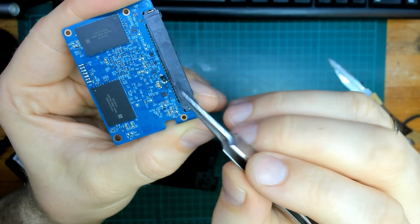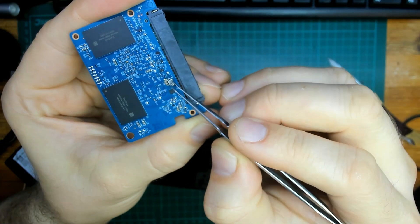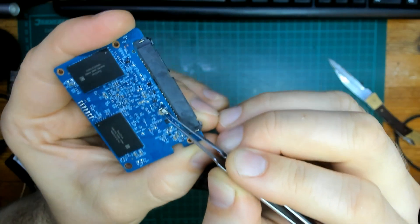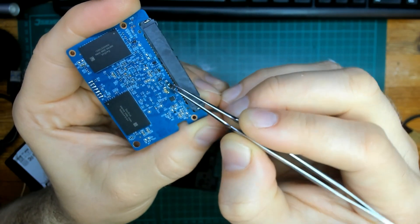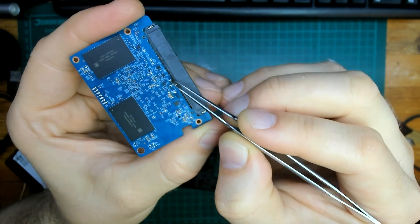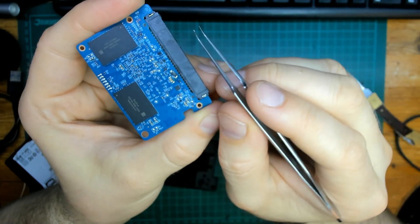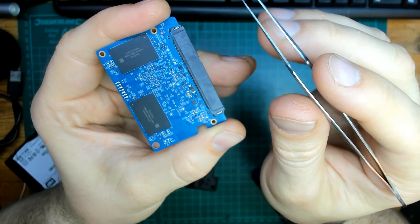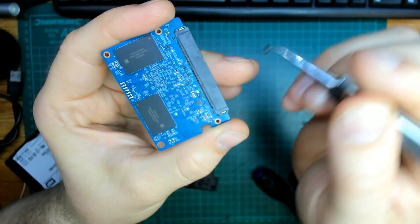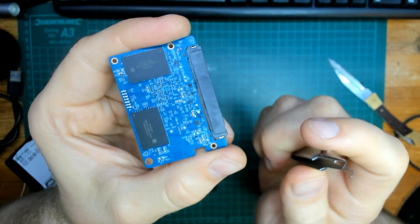So what I did was just remove the diode, because it had shorted. When I tried to plug the drive in without removing it, the whole system just froze — I was trying to plug it into my main computer and the system froze. So do not do that; check with a multimeter first. I'm not saying this is the case for all SSD drives, but for this particular one it was a really easy fix — I just removed the diode and it's working again.